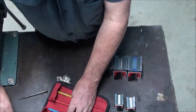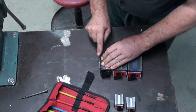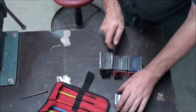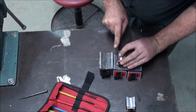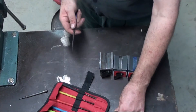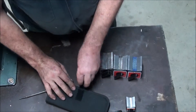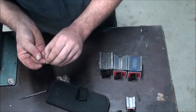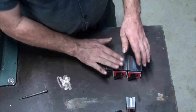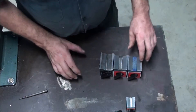This last one here is 40 Rockwell. And 40 Rockwell is coating these. So these are pretty soft, which is what you'd expect. They're all cast iron, but they're not hard cast iron. So what we know is we can actually run a pretty hard stone.